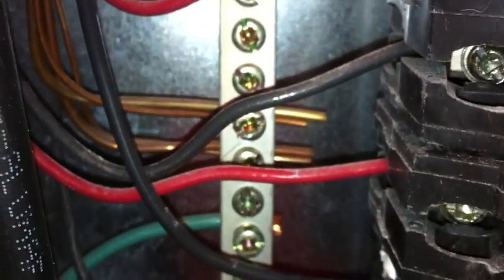As we look over here at the grounding bus bar, we have two, two — all of a sudden we have three, two, three, and three. So now these grounding bus bar ground wires are installed improperly.